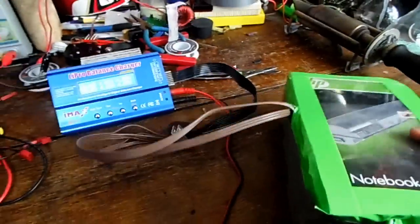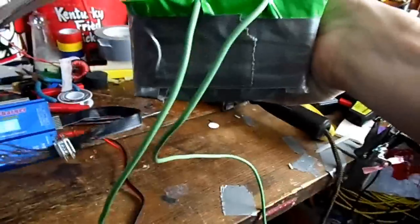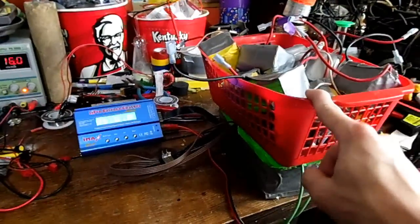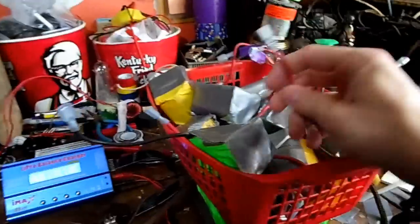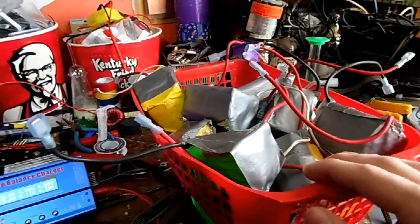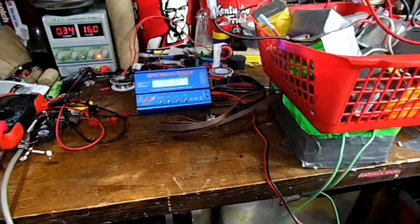Here's the battery pack put back together, nice and sturdy, with three connectors coming out: positive, negative, and balance. Now as for balancing the old battery pack, I'm not going to worry about attaching a balance lead to it because it would be too much of a hassle — it's kind of a rat's nest as it is. I'm just going to hook them together with alligator clips in parallel so they all stabilize in voltage. But anyway, thanks for watching, see ya.